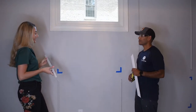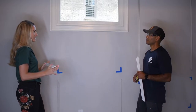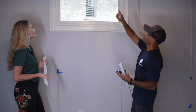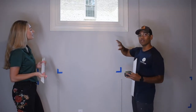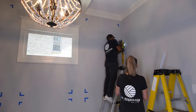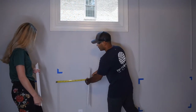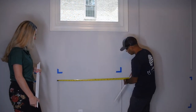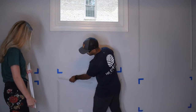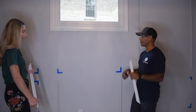So you painted all the molding and now we have the fun part of the process. Tell us a little bit about the layout. For sure. So we've mapped everything out by using some blue tape, that way we know where the boxes fall. Initially we do the vertical boards as they're installed. What that lets us do is come back, measure the horizontal boards, make the 45-degree cuts, and do the final installations to create the boxes. That's kind of the next steps and we'll go from there.